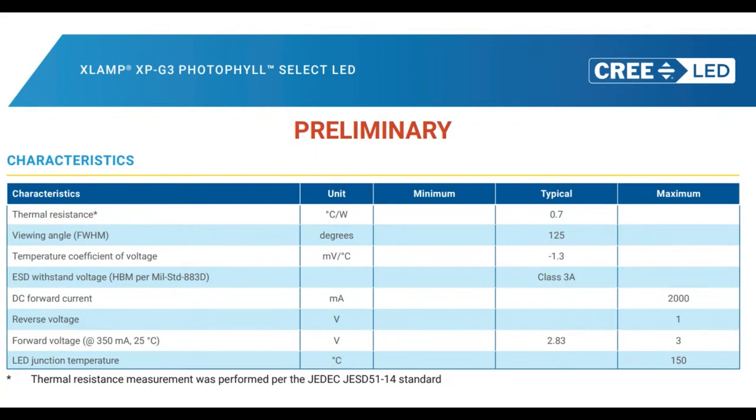These LEDs are very bright. Under DC forward current it's two amps — that's the maximum current range. So these are very small and extremely bright; definitely do not look into them. The forward voltage is about three volts, so at roughly a watt you'll definitely need a LED driving current management system. You can't just put a resistor on them at two amps — you're going to want buck converters, and you probably want to have them all in series, maybe boosted to a high voltage to control the current going through a string of LEDs.